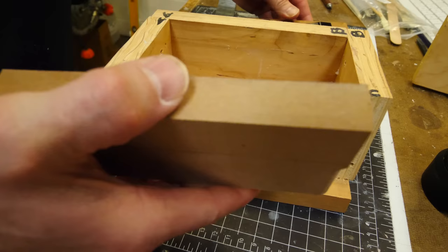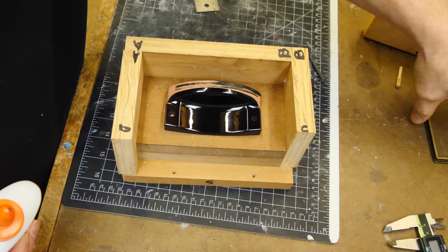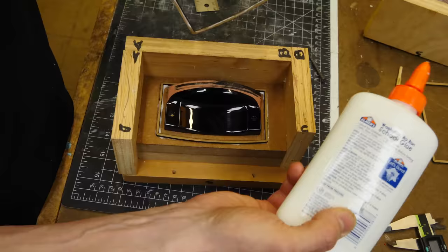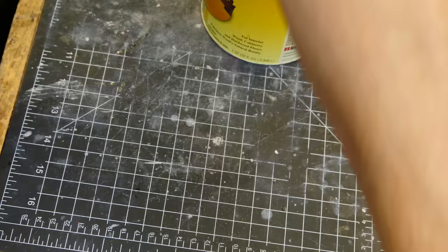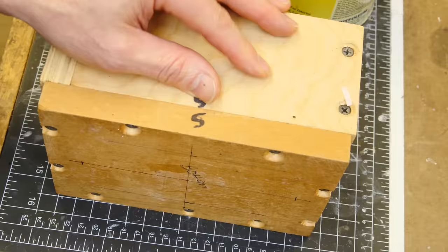I remove one side of the mold box and put in my two spacers that are the base for my part to make sure they fit. One of the last things we need to do before pouring our silicone is to make a registration key. This allows the two halves of the mold to go back together in exactly the same way and line up perfectly every single time. I'm going to cut some cardboard and glue it down with white glue — this becomes our keyway registration. I'll seal it with shellac, take it back out for better access, put it back in the mold, and screw it together.